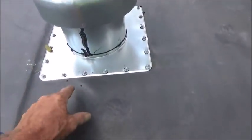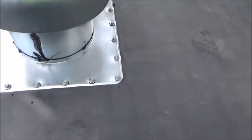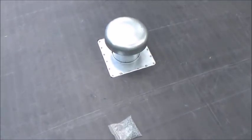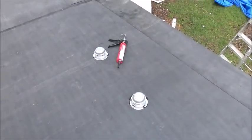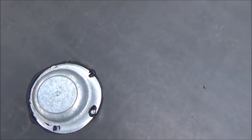This is something I wanted to cover. Underneath here there's a hole — this is vented. Right on this edge you can see some squeezing out. Just on the inside of that edge we put the EPDM caulk — caulk the crap out of it — and then screw them down into it. You can see it squeezing out here and there. Plus the vent holes — there's another one down there. So you want to put these on: just caulk underneath the vent, stick it down, put some termination bar screws in it.